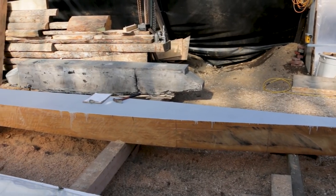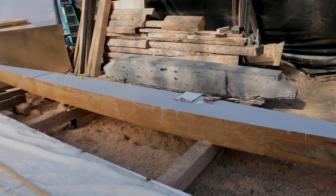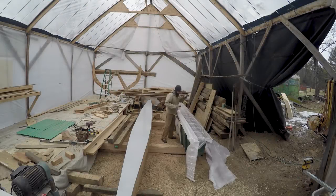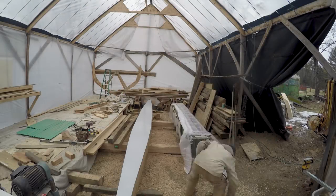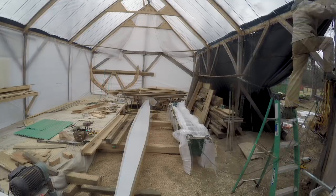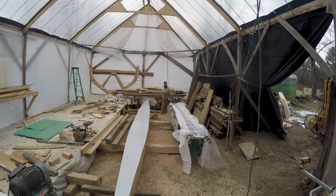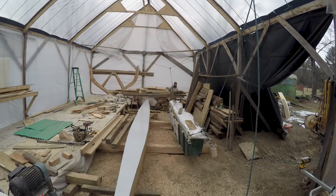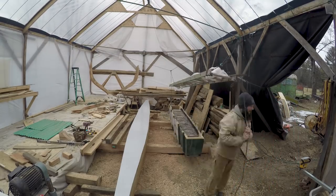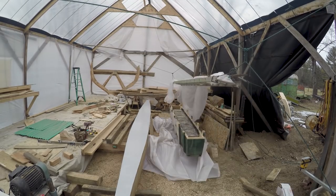With this face of the wood keel sealed, we shifted back to the lead keel. As some concerned commenters have already pointed out in the last couple of videos, lead can be very harmful if ingested. As cleaning up the top of the keel and routering it flat was going to create a significant amount of lead dust, we took the necessary safety precautions to contain it, and wore a full Tyvek suit and full face respirator. You'll understand why we have no footage of the routing of the lead keel.